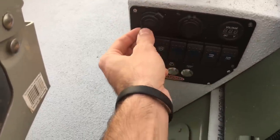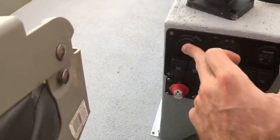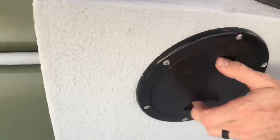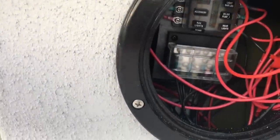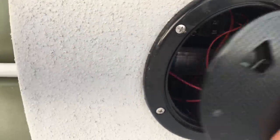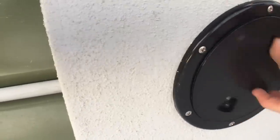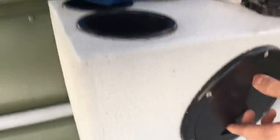USB charging ports, and then there's a 12-volt outlet that I use to run my live wells, bait tank, whatever. I added a couple cup holders up here. This hatch just screws off, and I've got my fuse box and bus bars and stuff mounted in there. The wiring's not the cleanest yet, but I might straighten that up. It's all tinned copper wires and everything's shrink-wrapped. I've done it all right, it's just not real pretty inside that box.